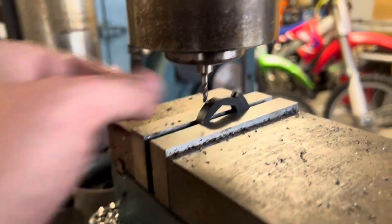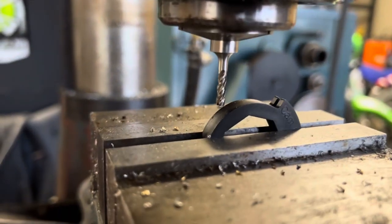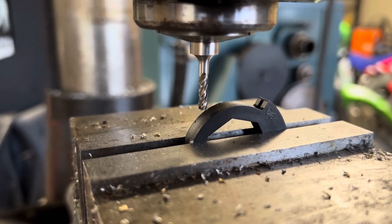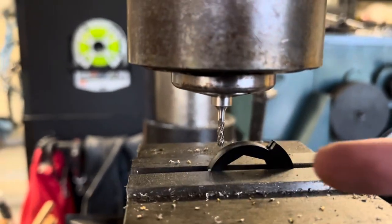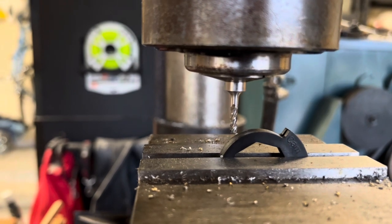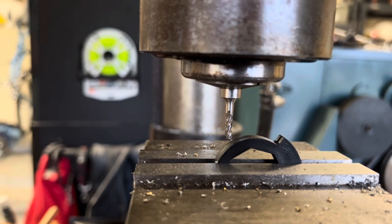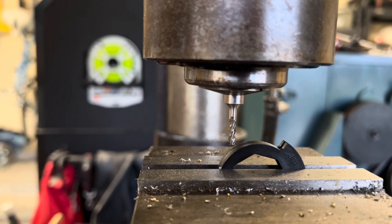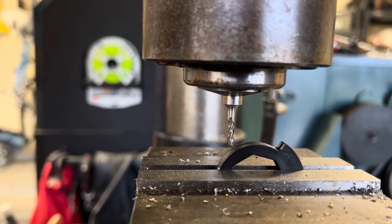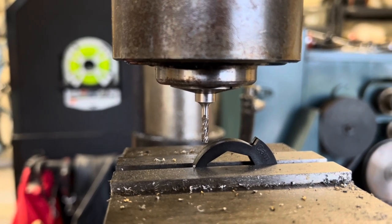I've got this cam set up with a 1/8" four-flute end mill — it's the only 1/8" end mill I could find, but it doesn't really matter since we're cutting plastic. I'm basically going to bring it across and cut a flat in there. I may rotate it and do a little bit more, then go back with a ball end on the Dremel to clean it up and give a smooth transition. We'll cut the bulk of it out right now and get a good channel that the ball end mill can ride in when finishing by hand.